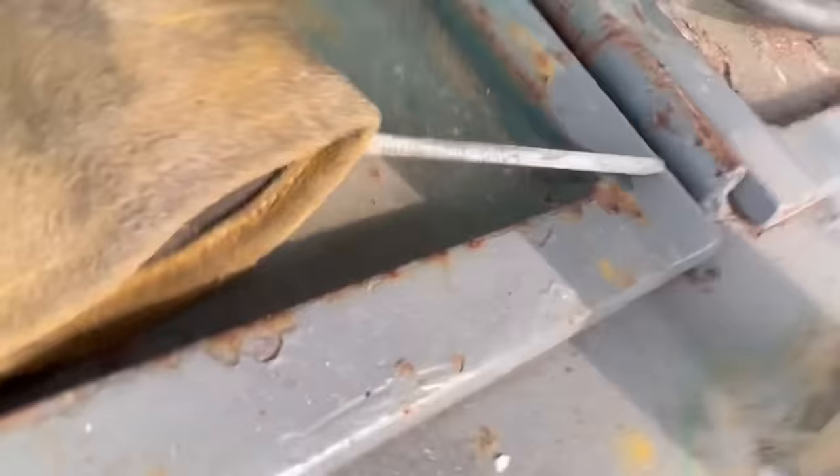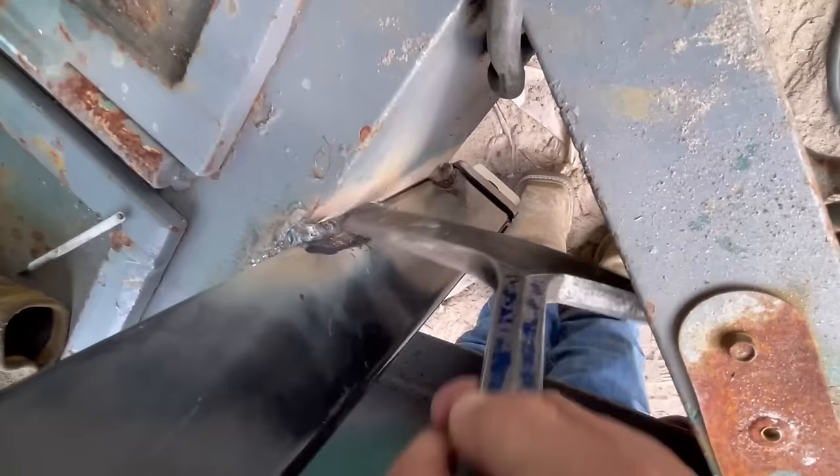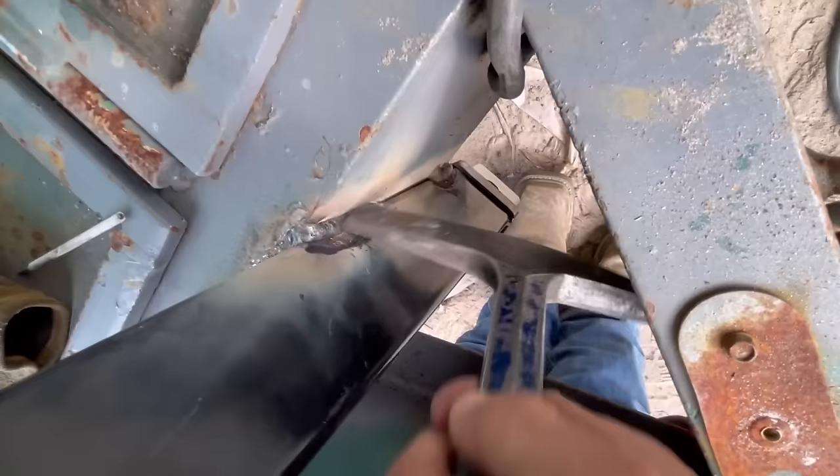All right, let's see what we got. It's pretty good. Should have gone a little hotter — hit the wire wheel on that — but you can see it's a good weld. Right here, you can always tell when you're running 7018 and you get these little bumps pretty consistently that you're going to have a good weld.